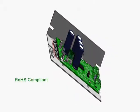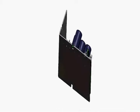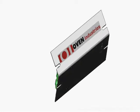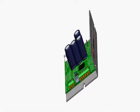The 5R7001 provides bi-directional temperature control for thermoelectric devices for both heating and cooling applications. The controller uses solid-state MOSFET devices in an electrical H-bridge configuration to automatically control the direction of current simply based on the temperature set point.